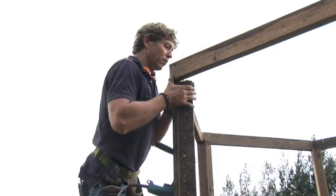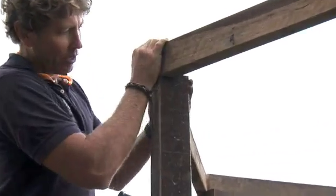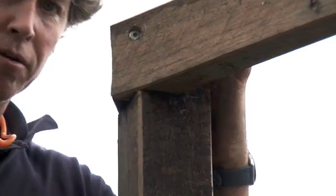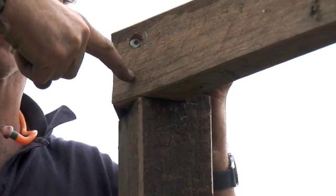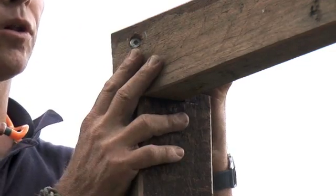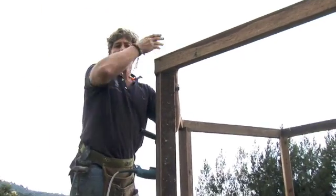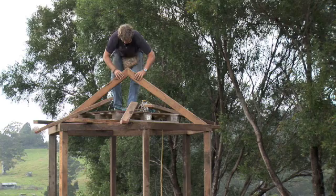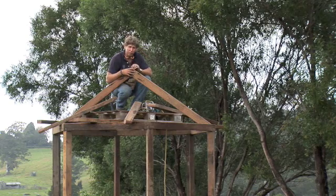Once you've done that, we then want to push those two rafters so that they sit neatly in the joint that we cut on the top of our post. We're going to drill a hole down through there into the top of the post, and run around and do that in each of the six positions. That's going to lock all this together, so that when it's time to put the rafters up, we've got this rigid hexagon there ready to take our rafters. The two primary rafters go together first — we're going to screw that together with a batten screw and then put up the secondary and tertiary rafters.